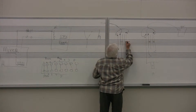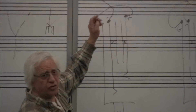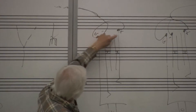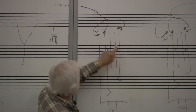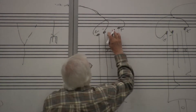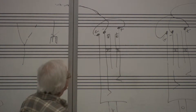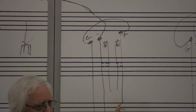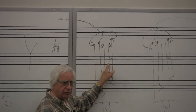Okay, let me go back and explain it. There's this little thing between these two. Right now the signal is coming from my bus one out — it's got piano on it — and it comes in here. The positive comes down, goes across here, and is on this positive leaf, because it's connected here. The negative comes down and goes to this negative leaf. These are the negative normal and positive normal. When I plug this in, it's going to separate this — so when there's a plug in here, these two leaves will no longer get the signal, because mechanically it just separated that.